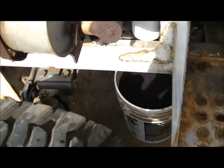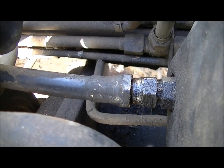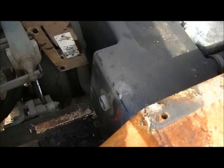As you can see, I just drained the hydraulic oil. She's just dripping right now. This fitting right here was leaking — the o-ring is probably screwed. This is the main feeder hose, so you have to drain the entire tank. Luckily it's only like a 4-gallon tank.